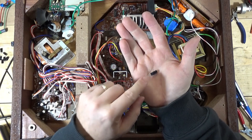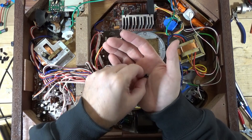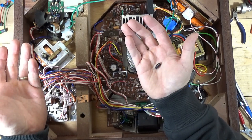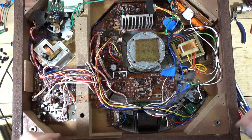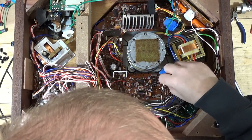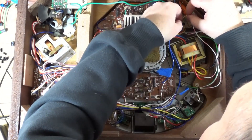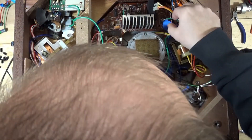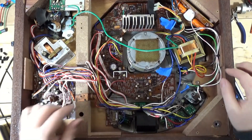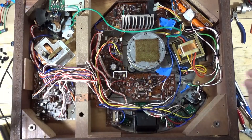I think that a capacitor in the rotation detection circuit — if the turntable can't figure out how fast it's going, it's just going to keep going. That's kind of what I'm thinking right now. So I'm going to put this back together. I'm going to try to re-wrap some of these, but that usually doesn't go very well, so I may just solder these back on. We'll see what I have to do — I'll put it back together, flip it over, and test it out.